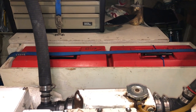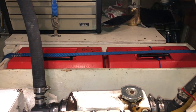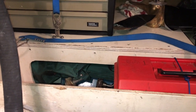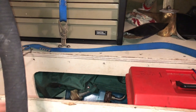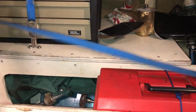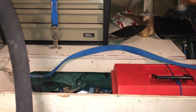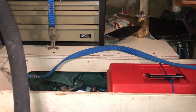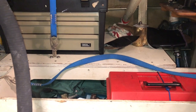There's also a ton of spares under the berth in the aft cabin, which we'll see in a later video, and there's a full inventory so if you're trying to find something, it's easy. I've taken out one of the red boxes — we go in underneath the top tool kit, where we keep really heavy tools that would be dangerous in a knockdown. The webbing goes over the red toolboxes and ties around the handles so they can't fly out. Down there we have a prop puller — there's no point having a spare prop if you can't get the old one off. You won't find a prop puller on the east coast of Greenland. There's also a set of hydraulic cutters because we have rod rigging, so ordinary bolt cutters won't make it.